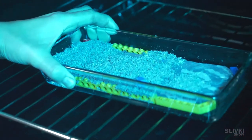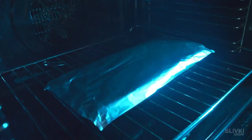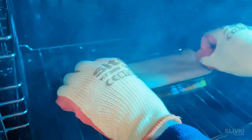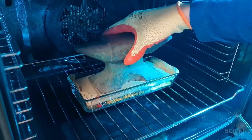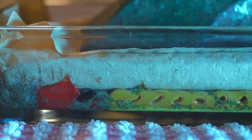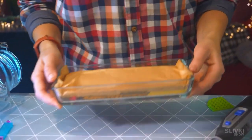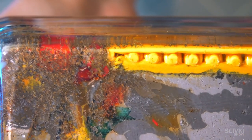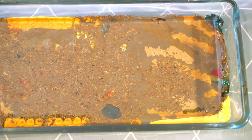After that, we put the mould into the oven and really hoped that we would get a solid moulded plate with no bubbles or voids. After an hour, we took the lid off — oh my goodness, what a stench. It stank up the whole house. Then we quickly put a board wrapped in parchment paper and put an anvil on top to press the plastic. We took it out of the oven and added another 20 pounds on top. Behind the scenes, I put my entire body weight on that to get the bubbles out. After it cooled down, around the edges the bricks were not much compressed, but close to the centre it seemed to be pretty good. Thanks to the parchment paper, the board came off without any problems and we really saw a smooth, even surface.